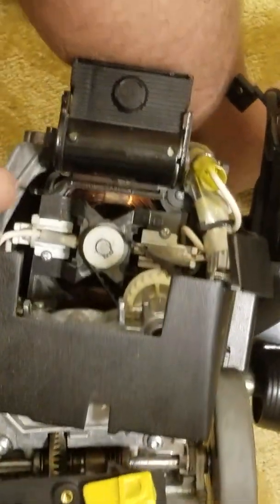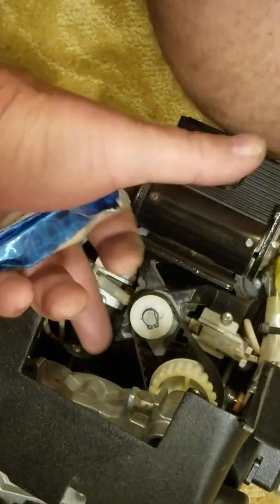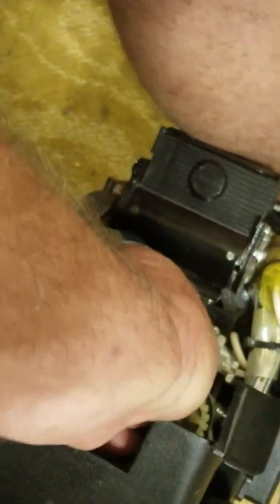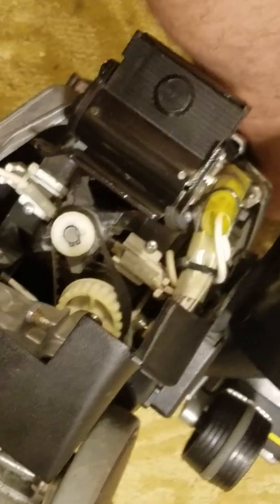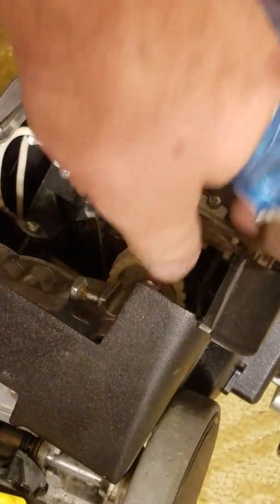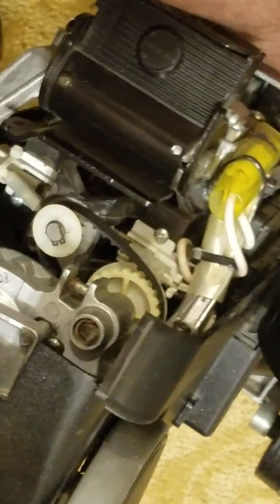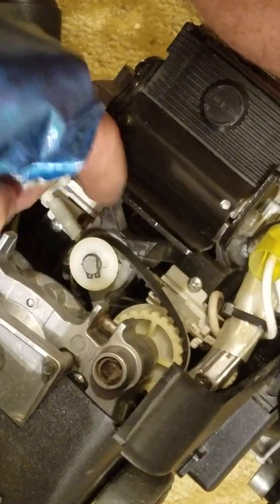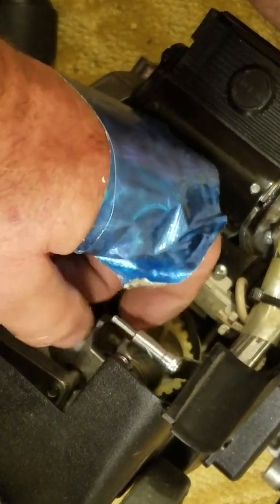Also, before that, even, you have to get this belt lined up and on the sprockets. Sorry about that. It's a belt. It's not a very big belt. It's kind of puny, but it works. And there it is. You can see the belt is in place there. And you want to do that as you're putting it in from the bottom. Get the belt on the big sprocket first, and then push the transmission in from the bottom. And at the same time, keep that silver rod visible and get it on the upper sprocket and things like that. So basically, there's the silver rod, but it keeps wanting to go way up here or way down there. So you want to try to keep it right there.